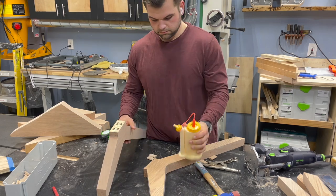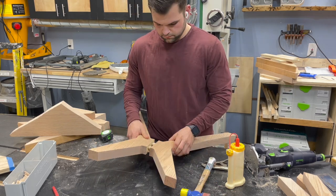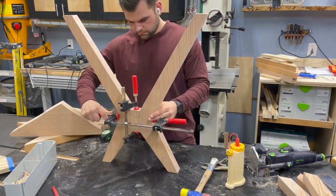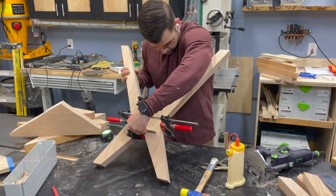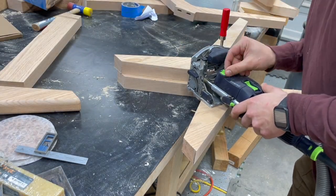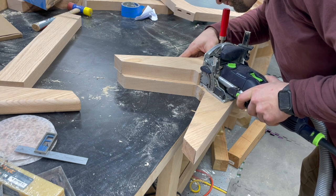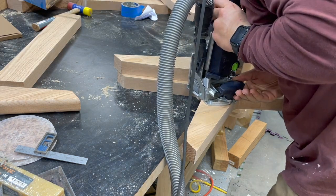It was cleaned up and ready for the first glue-up — just Titebond 2, a good go-to. I'm using a little F-style clamp to get everything at the same height and level. You don't need anything crazy — just close that glue gap, get a nice tight seam, wipe off the excess. Like I said, it's a super strong joint. To attach the other two legs, I'm using dominoes again and using the base plate as a reference to get them to fold right on top of each other. That domino is super fast — you've got to love this machine.